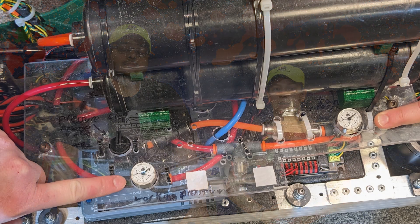Robots must have a pressure gauge on the high or storage pressure side of the main regulator and one on the low or working pressure side of the regulator. Finally, there should be no modifications to any of the pneumatic components per R803, and all components should be rated for the appropriate pressure per R802.